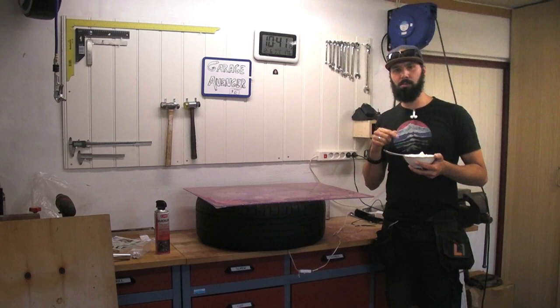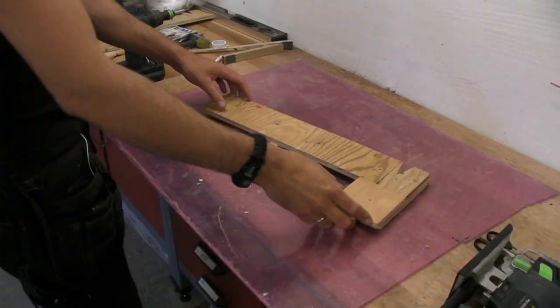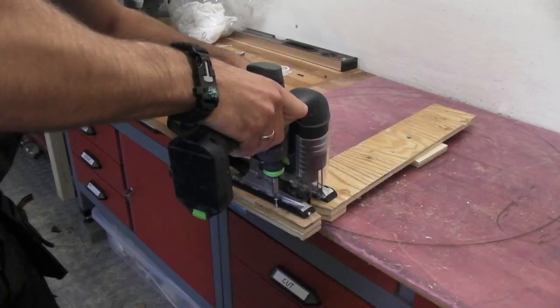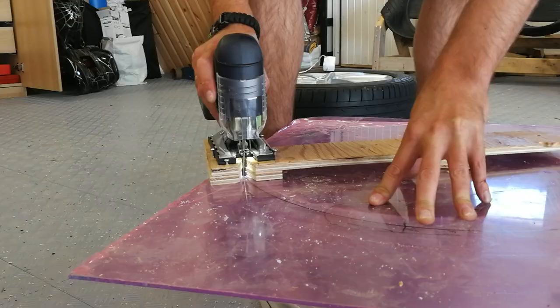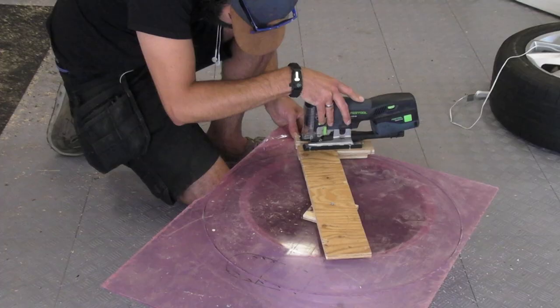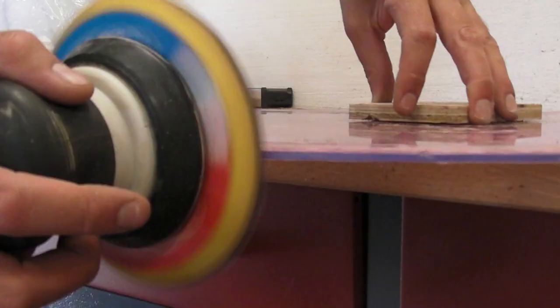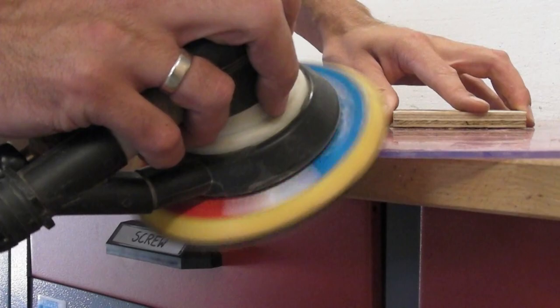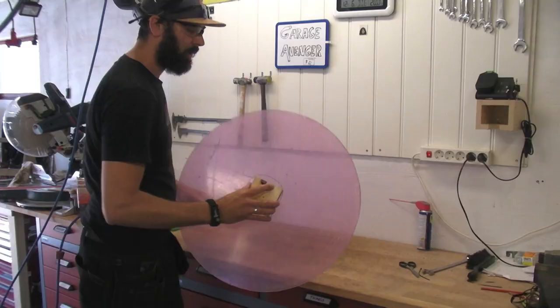I took some measurements to make sure I was going to cut it from the centre, and then I made this awesome jig out of some plywood. You can check the link below for a video on how to do that. Now it's time to cut it — and this worked out pretty good. When you're cutting plexiglass, you'll want to support it quite a bit because depending on your quality of plexiglass, it can crack really easily. After cutting, I used the sander to smooth out the sides and round off the sharp edges. A rough freehand circle would have been a lot worse, so I'm glad I did the jig.